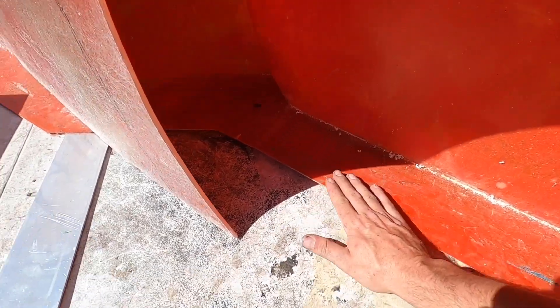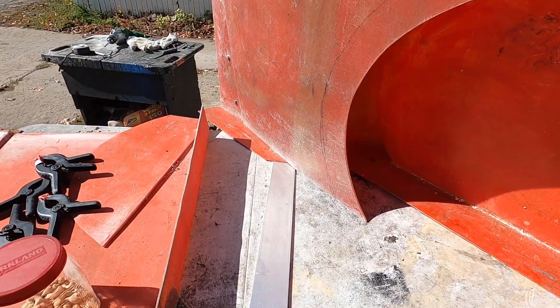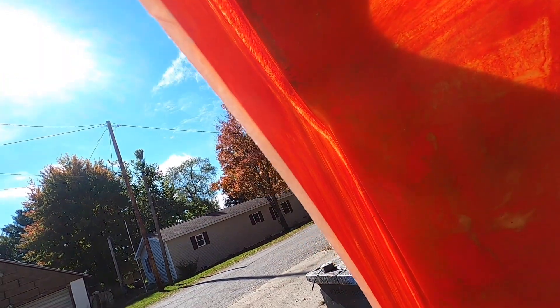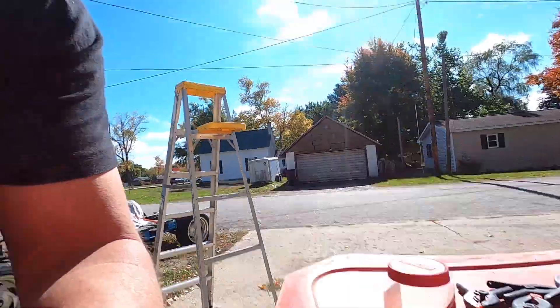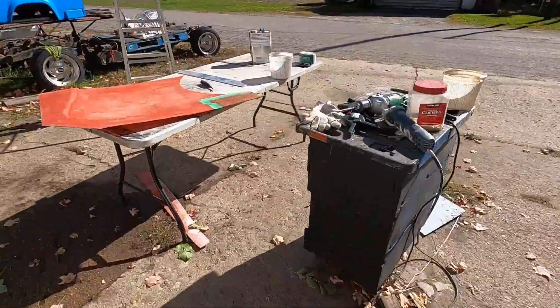I have to build up flanges down here and build this flange out as well. The bag will be sealed using a little bit of tape between the seams and the insides of the bolts - it'll keep the whole thing from filling up and serve as a vacuum seal. There's a little more room in here than I thought, which is nothing but good news. The molds are mirror image, so my plan is working. It's a bit more work than I thought but it's gonna end up being a better product, which is what the second Envy is all about. PVA is sprayed on and it's ready to go.